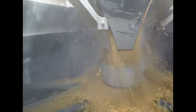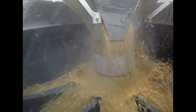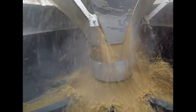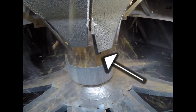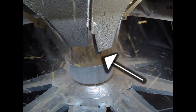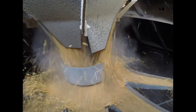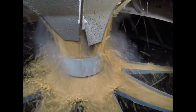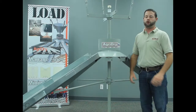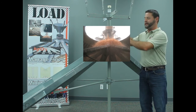The only time that we don't overflow over that leveling band is with some low-rate fill spreaders, such as those coming out of a dryer or an air system — anything where you have a low fill rate and you actually have a black tie bar insert inside the hopper. With those inserts, the opening is narrowed down and that helps center the grain. In that case, we typically run this leveling band about an inch and a half to two inches above the cone so the grain goes through the leveling band without overflowing. All other situations, you want grain flowing through and over that leveling band.